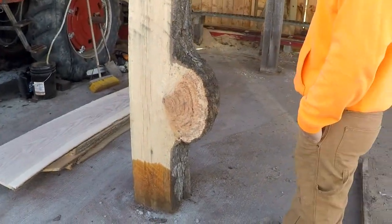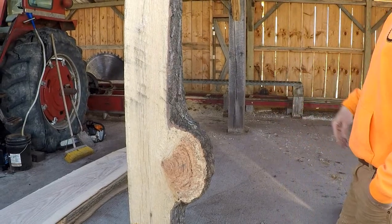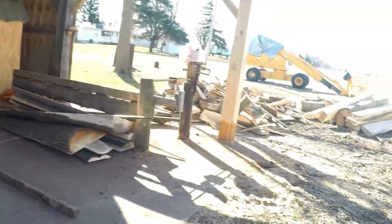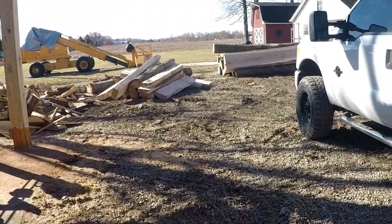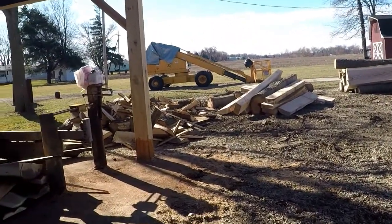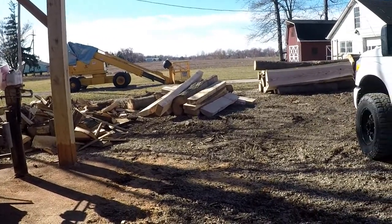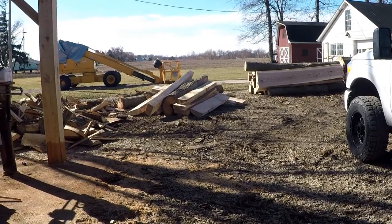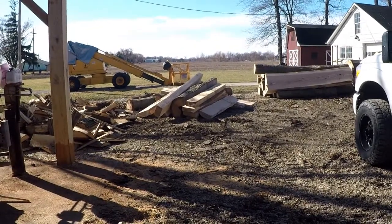But yeah, that's the only reason I bought that tree, because I wanted it as a post in here. But yeah, you're looking for a bandsaw because you end up with a bunch of pieces like that that you can't cut up with your saw. The saw can only get down to 2 3/4 of an inch absolute minimum, because that saw was designed to cut beams into 1-inch boards, so they would square their log, make their 1-inch boards, and get down to their beam. They never had to get down to making anything small.